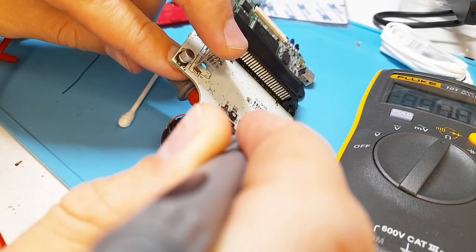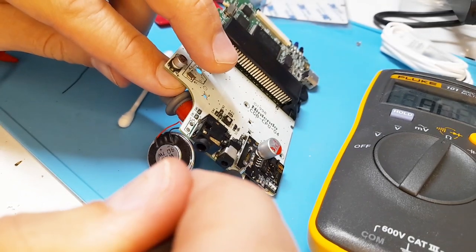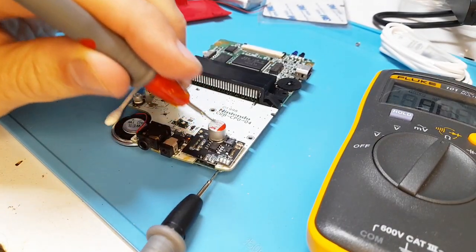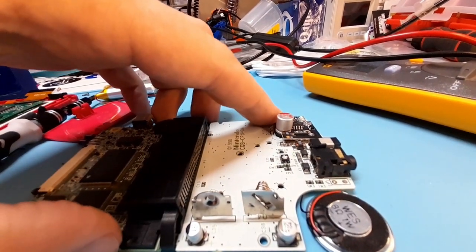I'm sure that would have worked — let me know in the comments if you think that's a bad idea. Once you have it all soldered on, check continuity on the top and bottom of the two boards to ensure that all three points are connected. I also pushed around the board to ensure those solder connections are solid and wouldn't break.